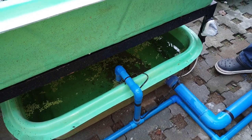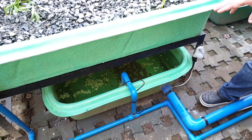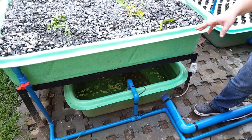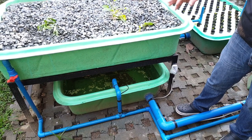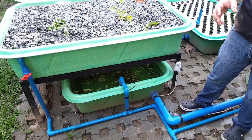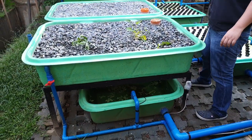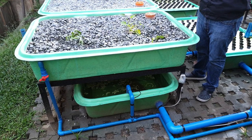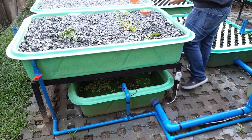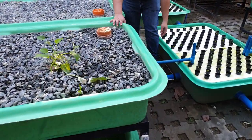Because this is a decoupled system, when there's a problem with fish you can treat the fish with a little salt, because the RAS component is not directly connected with the hydroponic component. So how do we get the nutrients from the fish water to the hydroponic component? We have a bypass valve over here. Let's go to the bypass valve.